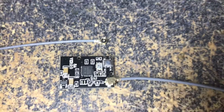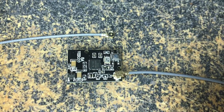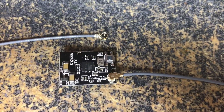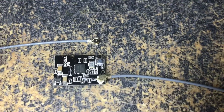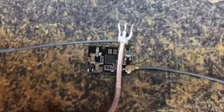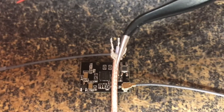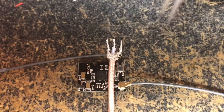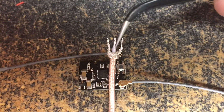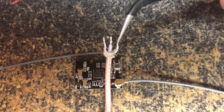As you can see, these UFL things are really small - they're my finger-sized. And while my finger's pretty big, those are little tiny deals. So when you're doing this, remember that these cables are made up of essentially a few things. We have the outer sleeve, we have shielding which is all like mesh, then we have an inner sleeve right here, and then this is the core - that's the element, that's the transmitter right there. Think of it this way: positive and negative.